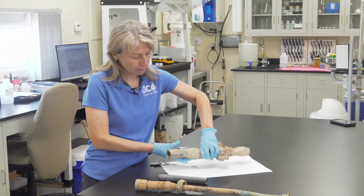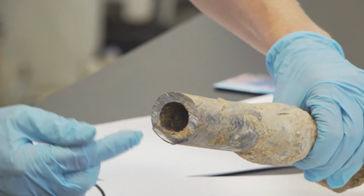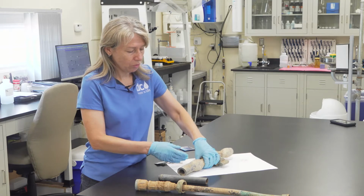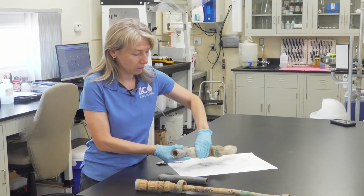Also, the lead is kind of heavy, and you can see the thickness. It's a very thick pipe, so it'll generally look kind of big. If it connects in your home to the shutoff valve and then you see a thinner pipe above the shutoff valve, that's another indicator you've got lead pipe, because it's just a bigger pipe altogether.